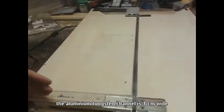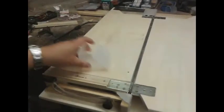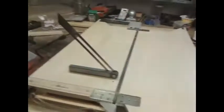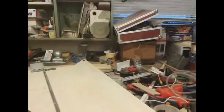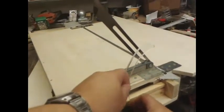I've got a ruler this time instead of just a piece of wood — it's about two or three millimeters high, but that's enough. When I take some Plexi I can put it against it so that I can align it at 90 degrees. So if I want to make an angle, I measure whatever piece I want to make, put the angle part here, and set that angle. I've made a jig here which can be set as well to match that angle.